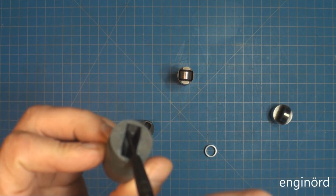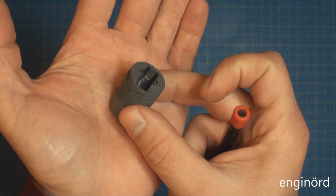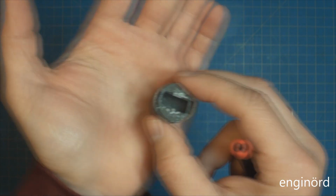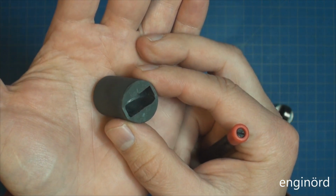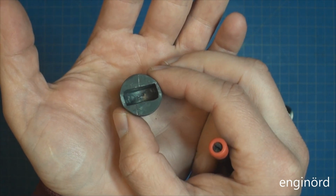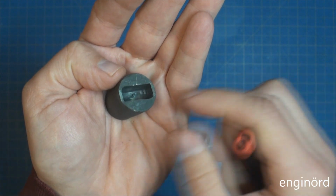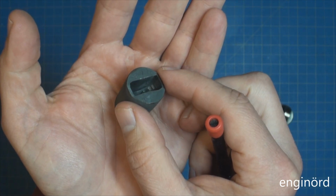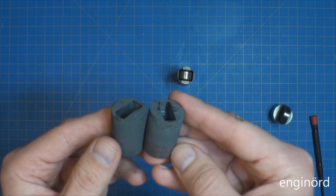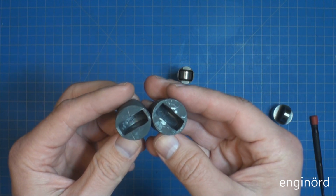Here's the other one. This also has the tool marks, the machining marks remaining from the CNC process. Trying my best to show it to you. Here's the other one. Again, you can see the residual tool marks from the CNC machining process. So as the ball end mill went down and carved out little by little, those layers are still visible. Doesn't have much mill scale. I can tell you the swift heating process did its magic and didn't create too much mill scale.